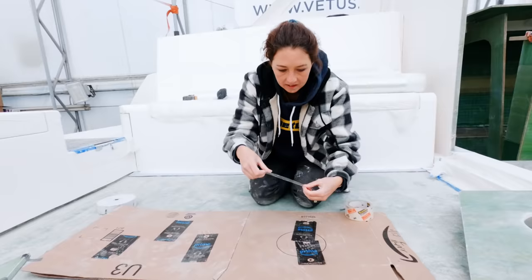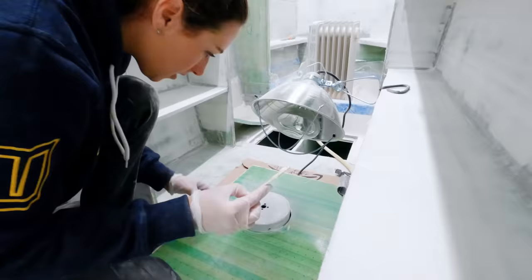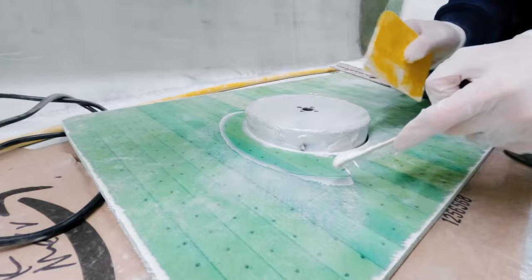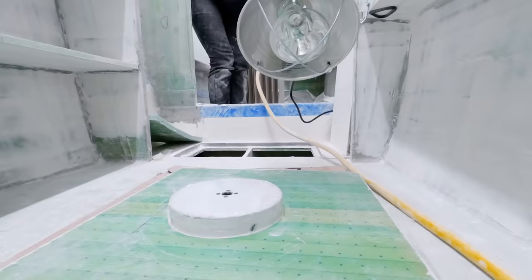Because temperatures were still below the necessary 60 degrees, I brought the boards inside the master head, which had already been sealed off and warmed up with one of our radiator heaters. My first attempt had me filling the gaps using a tongue depressor, trying to push the filler down as far as possible. My plastic squeegee was initially just to clean up the excess, but then I realized that sharp corners could help me press the filler even further down.